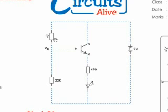Assuming it is dark and resistance is very high, the voltage here will be 9 volts and here will be 0 volts. If the voltage reduces, some voltage will come over here — so this could be 7 volts and here 2 volts. Basically, the sum of the two voltages across these two components will always equal 9 volts.